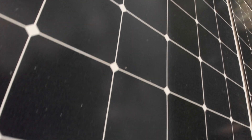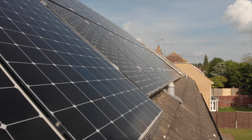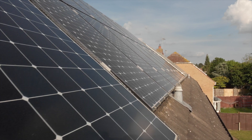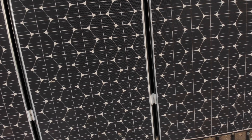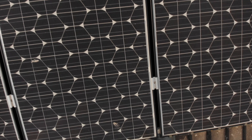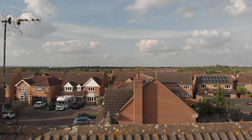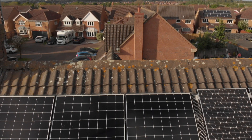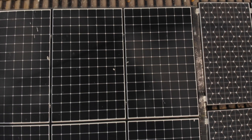The first thing to chat about is: do you need to clean your solar panels? I see a lot of people in forums and social media saying they don't need to clean their panels because the rain cleans them. That's a bit of a fallacy — over time if you don't clean them they'll become dirtier and potentially get a build-up of green algae, which will then promote lichen growth.